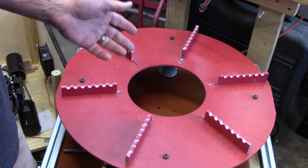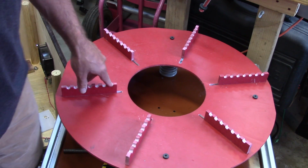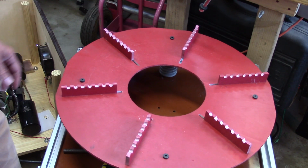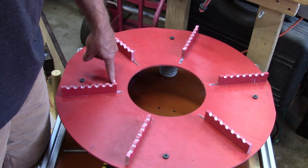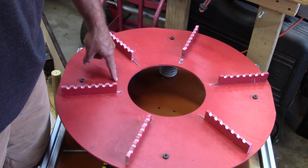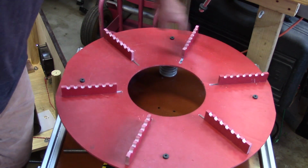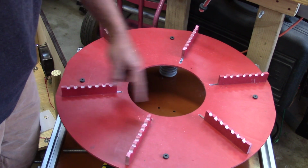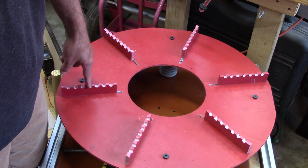It would matter if you were doing radio equipment or something like that, but it does not matter in a coil. I've got this set up for a counterclockwise spiral at the moment, which means that the coil start is going to happen right about here. I'm going to have to drill a hole here. I have to move this, bring this around that way, and it'll end up on the 4th turn. As I remember, we counted 4 turns.